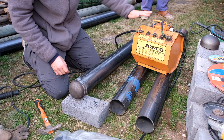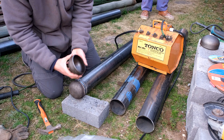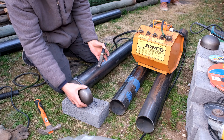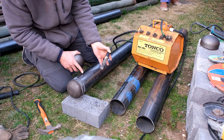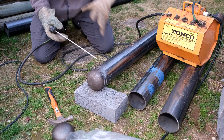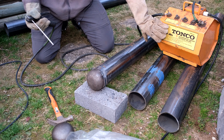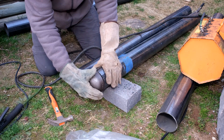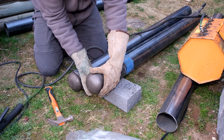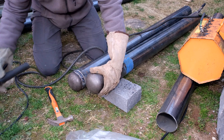I've got an old-fashioned welder — you probably have a more modern one. What we need to do is weld the end caps onto the pole. It's best to weld them on now because you can clamp your earth lead on the pole. I'm using a 3.2 millimeter electrode with my welder set to 140 amps on a 220-volt welder. I hold the end cap in place, feel around to make sure it's not protruding, then tack it in a few places to hold it.